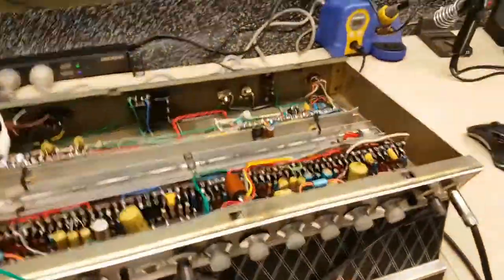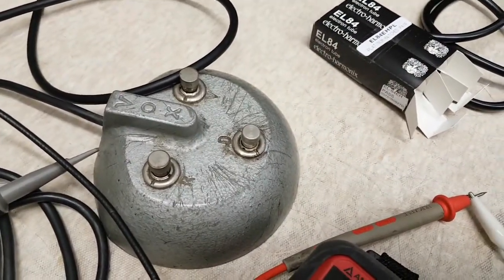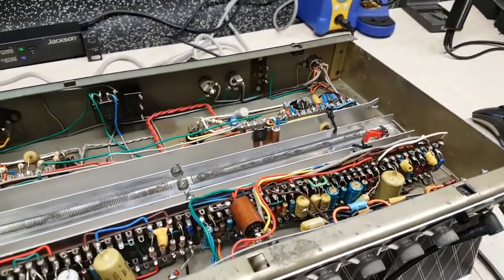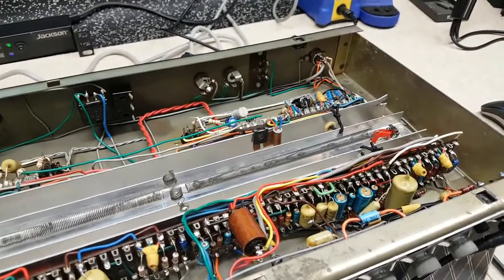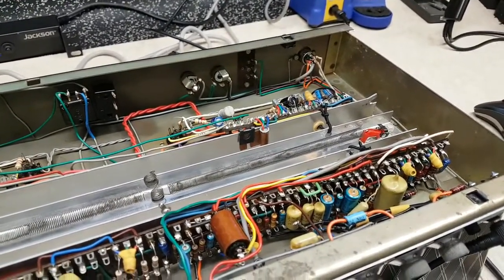The distortion circuit is quite unique. Here's a little footswitch which you need to control it. It uses back-to-back germanium diodes, very similar to a fuzzbox technique, and then switches in a boost circuit to recover the signal level after that hard clipping with the back-to-back germaniums.